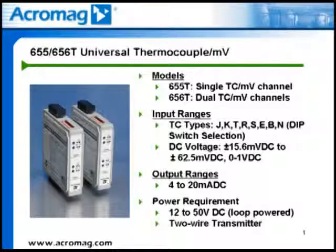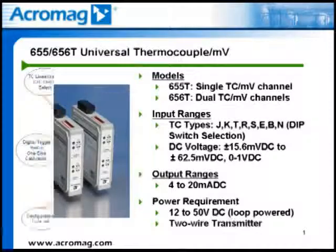The supply voltage must be chosen to supply full-scale current to the load, 12 volts to the isolator, and any voltage line drop. This can come from an external power supply or excitation supplied by the load, such as a powered input to a PLC or DCS card.